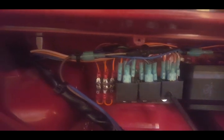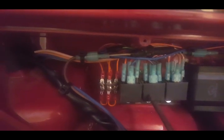So you've got the start relay. It'll be the starter. When you press the start button, it brings in that relay and closes the circuit for the starter solenoid. Starts it up. And then to kill, you need to bring these 2 relays in together. So they share a common channel. I'm just using 2 channels, 1 channel to start, 1 channel to kill, but the kill brings in both relays, which is exactly what happens on the key start.